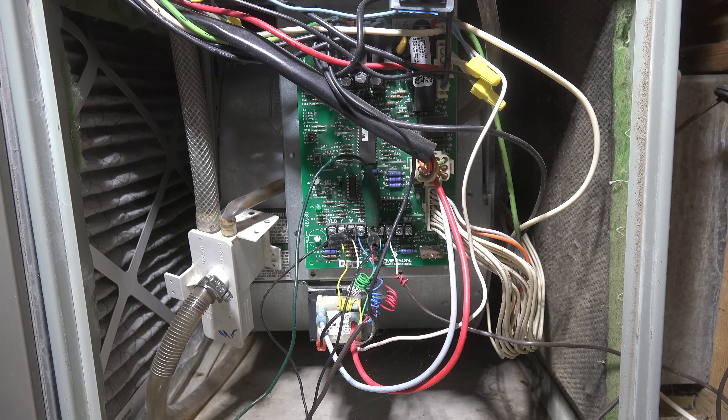In this video I'm going to show you a way to get your furnace to go into high fire without waiting the 10 or 12 minutes it would normally take. If you turn your thermostat up very high it turns on W1 and W2 at the same time, and doing that means it takes 10 to 12 minutes to go to high fire. There's a way to get it to fire off right away without waiting.